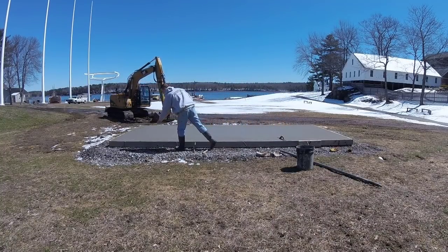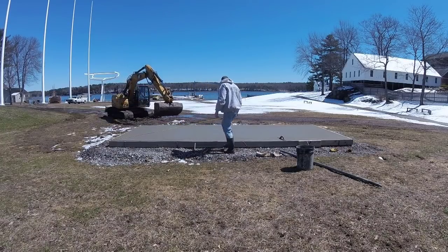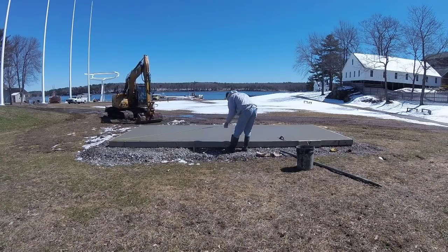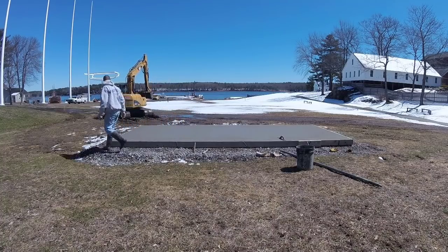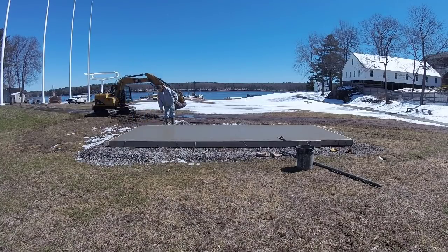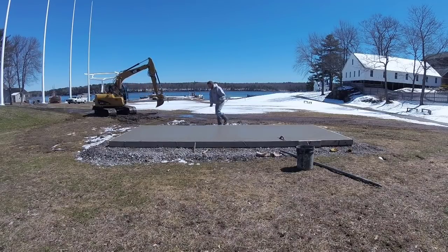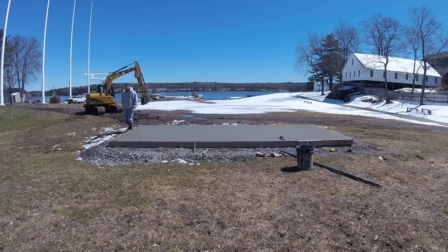What I'm doing right now is measuring out the center — this slab is 20 feet long so the center is at 10 feet. I'm just putting a little mark in the concrete with my finger. Now I'll go over to the other side and do the same thing — just put a little mark in there, and that's where the groove is going to go, right on that 10-foot mark.